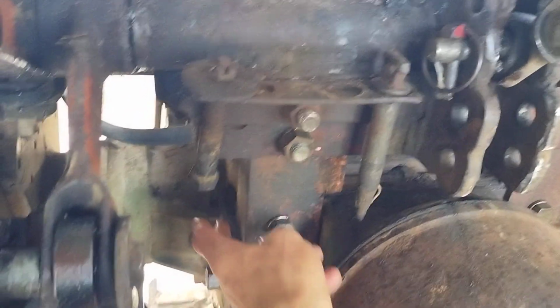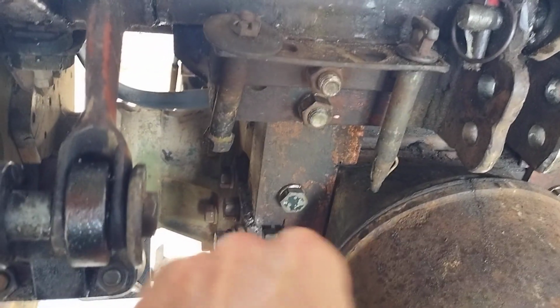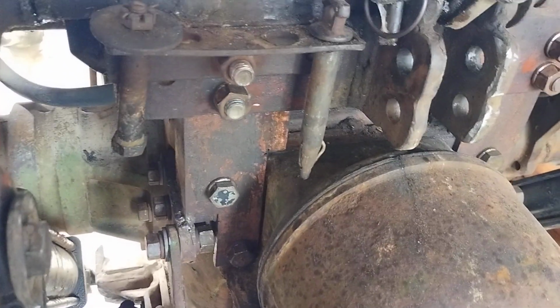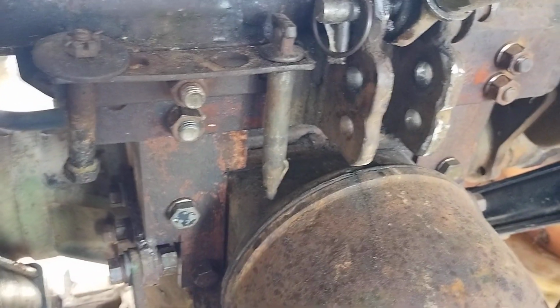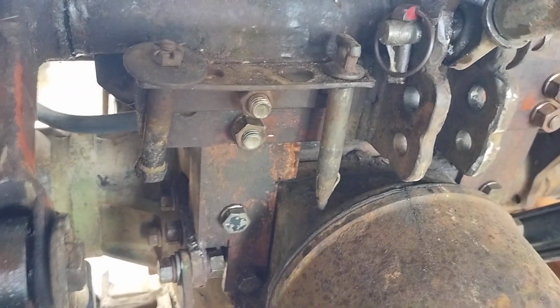The top of these angle iron, I had to notch it out on the sides a little bit. This one I actually had to put an inward bevel on it because it ended up standing just a little higher than the other one. Had to measure the distance from the top of the axle housing there to get them even, so that sucker will fit level on there and not be leaning to one side.